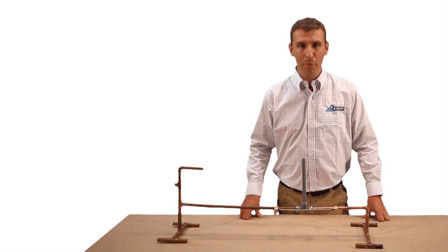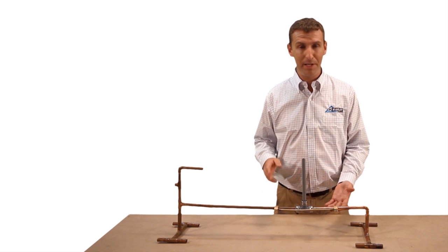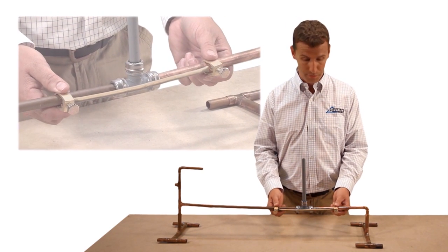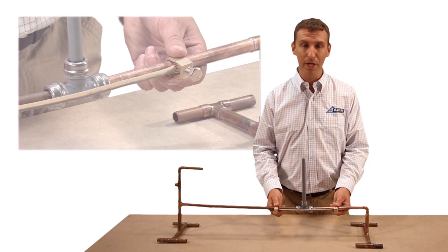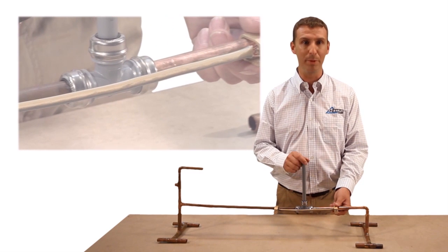When a section of Equator PEX piping is installed into an existing copper pipeline, the electrical continuity can be maintained by fixing a permanent earth wire using appropriate electrical clamps in order to link both pipe ends of the metal pipe before the pipe is cut.